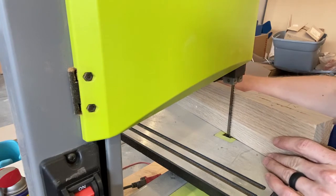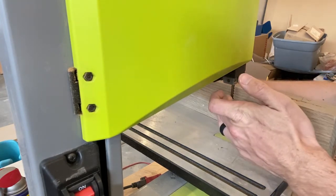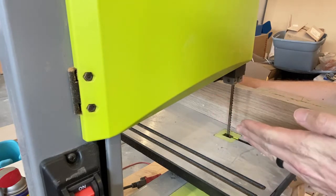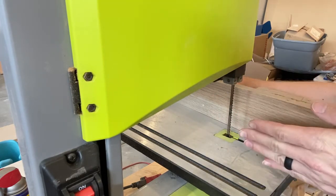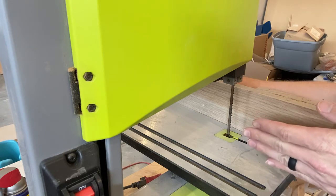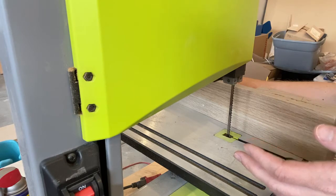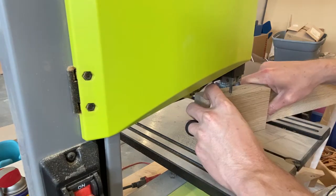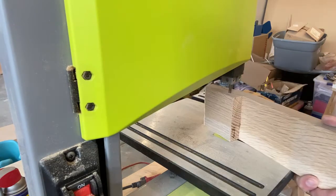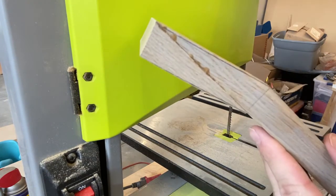What we're going to do now is carefully cut this out on the bandsaw. You can see there's a lot of blade exposed, which means the blade is more likely to walk and not stay perfectly straight up and down. So I'm going to cut it really slow and make sure that blade just slowly chews away at the material. And there you have it — a bent neck.